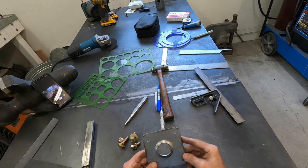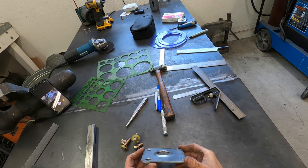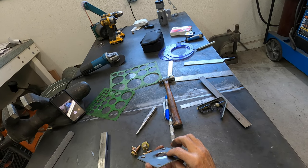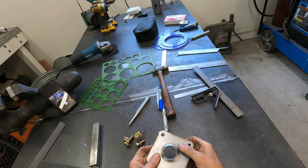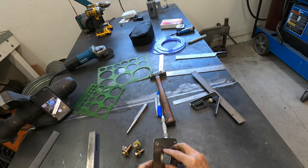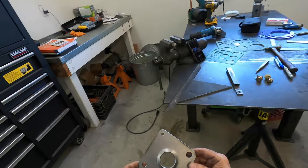The reason people use dimple dies is they look beautiful, obviously, but the main reason is because they add dimension. It adds a thickness, and that tends to make it less vulnerable to bending. So it not only looks nice, but it adds thickness for strength and you lose a little bit of weight. That's the purpose for it, although I think it's highly overused.